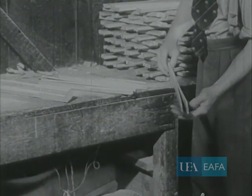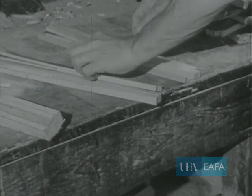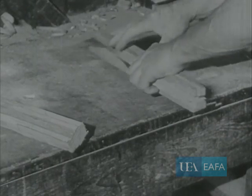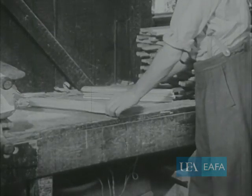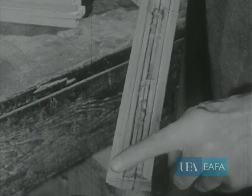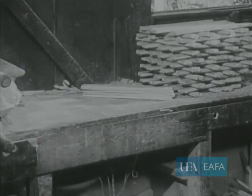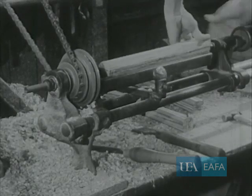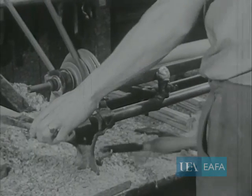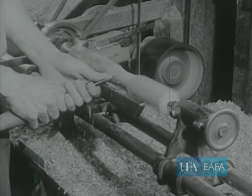The two innermost sections are slit and a length of rubber is inserted. Between two sections with rubber insets, a spacer and a length of rubber are sandwiched. A fourth slat completes the assembly. The whole is glued together to form a springy handle with rubber inset shock absorbers. This rough square assembly is turned into a round handle.